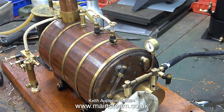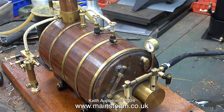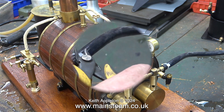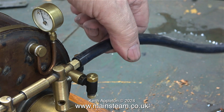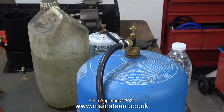I held the cloth against the burners and the water in the cloth turned to steam — these burners are really hot now. They were quite hot with the original configuration but nowhere near as good as this. I've turned off the gas, removed the cable tie, and I'm withdrawing the gas pipe to fit another silicone rubber gas pipe, which is currently connected to the large gas canister.